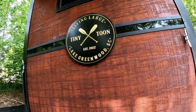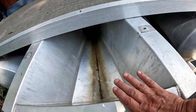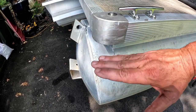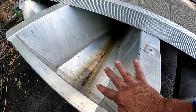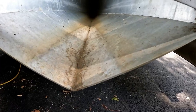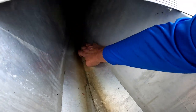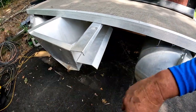The idea came about on paper over the holidays in 2022, and we're building here in 2023. When we put this in the water, the back end sat a little low, and with the motor and additional weight I'm afraid it might go under. So what I'm going to do is fill this large cavity full of liquid foam for flotation — it extends as far as my arm can reach up in there — and then we'll get prepped to put our outboard motor on.